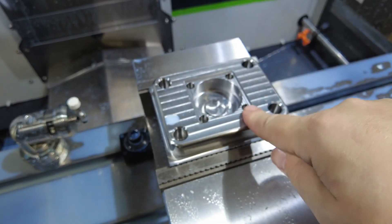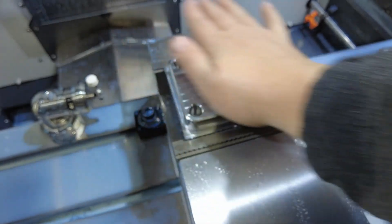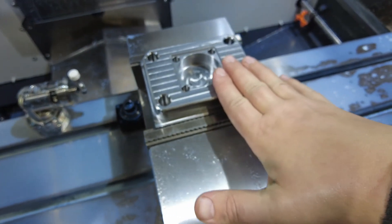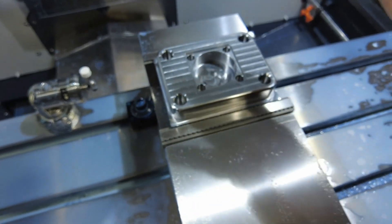I had some pullout issues with the end mill in the tool holder — it's a tool holder problem I'm working on getting fixed right now. Those tool pullout issues happened during roughing, but it shouldn't have actually made a difference on the final part because it would have finished everything at the right depth anyway. It just roughed a little bit more than it had to.